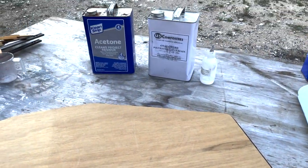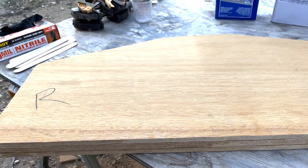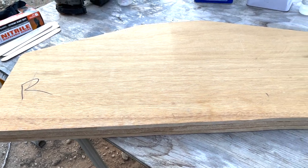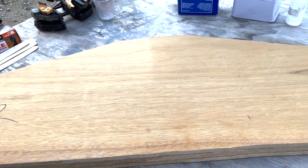When we add the 435 polyester resin, we'll probably gain maybe an eighth inch, give or take. And keep in mind, we also have to coat this with fiberglass mat as well. So this will probably end up somewhere around two inches by the time everything is said and done.